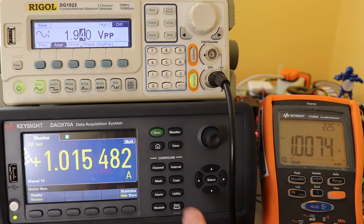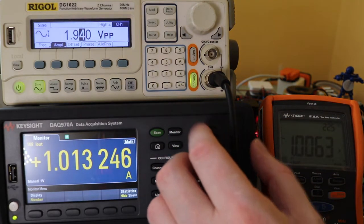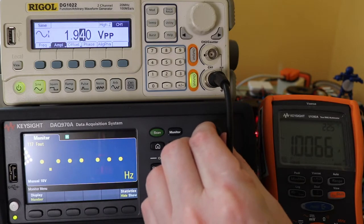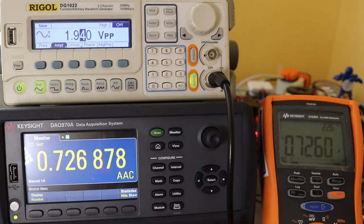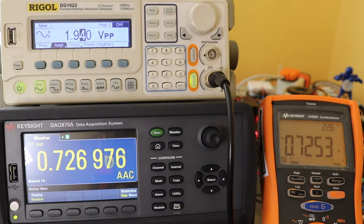And then on our current clamp — oh, that is our current clamp — so that is the clamp there. When we go up to 1.2.1, you can see it changes and then drops. There's 0.727 against 0.725. It's quite close; they match one another, but I'm dropping some amps somewhere along the line.